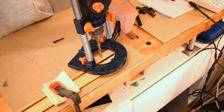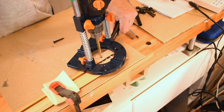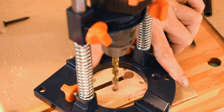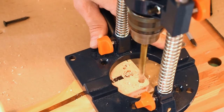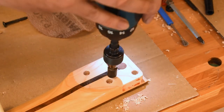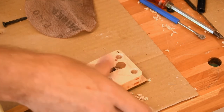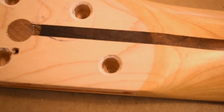I know this is a painful procedure for some of you — it's a one-shot-only deal, so you have to get it right. But it's not really hard. If you use a drill bit like this one — it's actually for steel — it will make a perfect hole. I have a stopper set for about 10 millimeters depth. You can measure yourself how deep you want to go into the wood. Then use the countersink again — this is really important. It prevents chipping when we put in the inserts, seating them a bit deeper and preventing breaking at the surface.